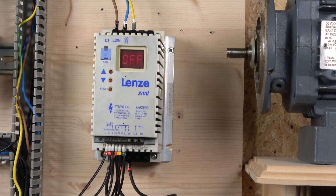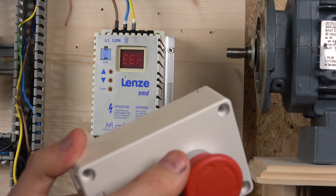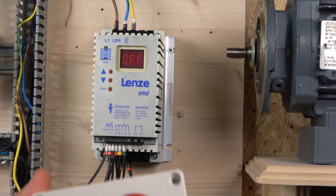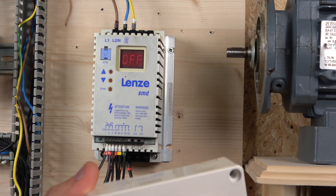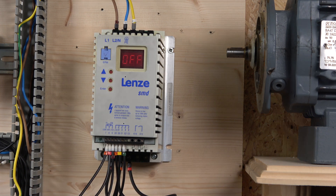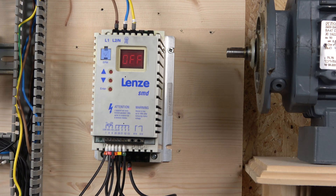If the circuit is broken, the drive will show an error. To release it, you flip the switch in and flip it back out. If it's activated in an active state, it will error. When you release it, the error won't clear automatically while the drive is enabled — but as soon as you remove the enable signal, it will reset the error automatically.